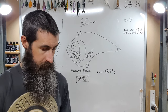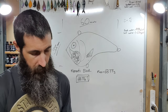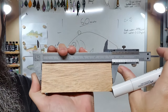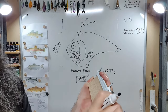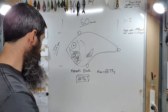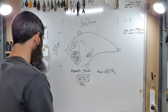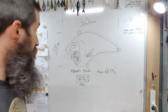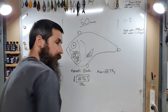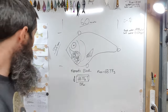Next we need to get the measurements. So this block of wood, I don't know whether that'll focus on that or not. We've got 137, it's probably about 0.2 millimeters over, but I'm not going to worry about that for this, by 66 on the dot. This is pre-dressed timber, so it should be fairly square. Millimeters tall, I think these were 18 mil. Yeah, 18 mil thick.